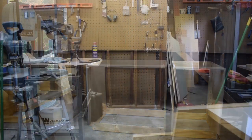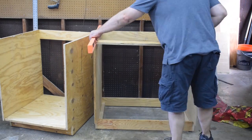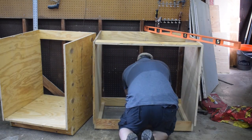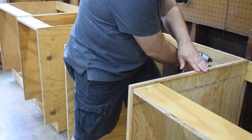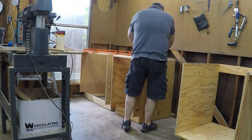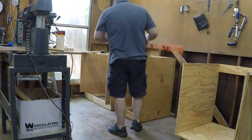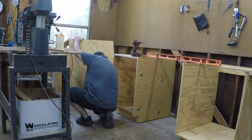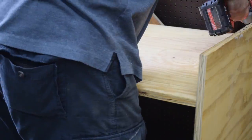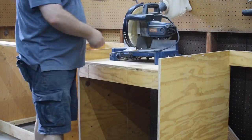I built the cabinets one at a time, cleaned off the wall, and put them in place. Then came the task of leveling them. I did not realize when I started that my floor was as crooked as it was, so I'm glad I started at the high end. I wanted to level them together so it was one straight, flat, level surface all the way across. I also had to worry about the gap in the middle, because it had to be a specific size to hold the miter saw. Then I cut some pieces, built a shelf, put a front on it — at the right height so the miter saw would be level with the countertops all the way across.